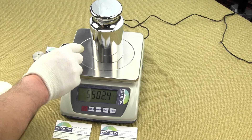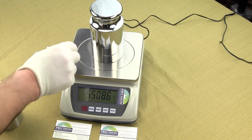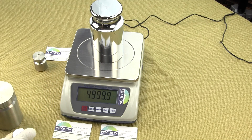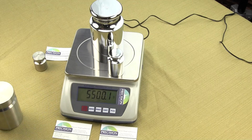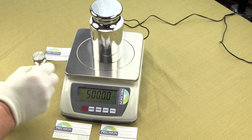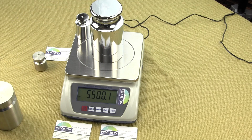Calibration is simple but does require the purchase of an optional calibration weight. Before calibrating any digital scale it should be turned on for at least 10 minutes with nothing on the weighing platform. All scales should be warmed up for best calibration. The EPB is one of the few scales on the market that allows you to select a different size calibration weight. We always recommend at least 50% of the weighing capacity, so with the EPB 10k we recommend you use a 5 kilogram weight.